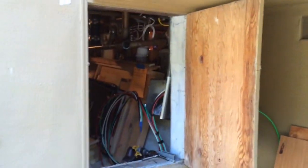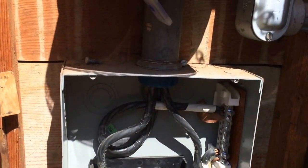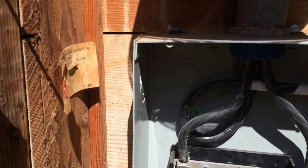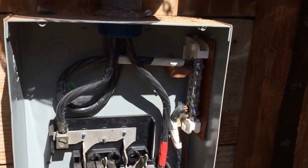The last piece I have to make is an offset that mimics that one, to go into the box higher up. I'll show you what that looks like with the cover off. There's where I'm working inside. You see where that wire with the white tape is landed, and the other wire with the white tape - that little terminal strip has to get removed and relocated over to the other side. That will allow me to make a knockout where the terminal strip is and come right into the side of the box with this conduit I'm running. Those wires will come in and land where you see the red and black ones.